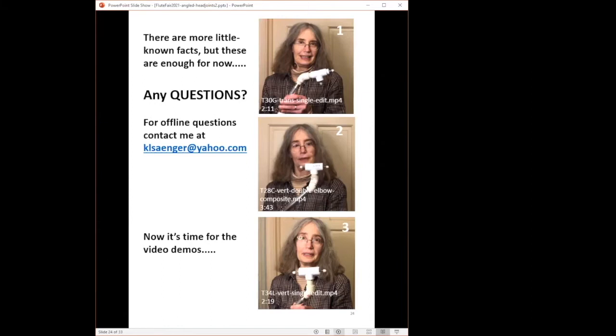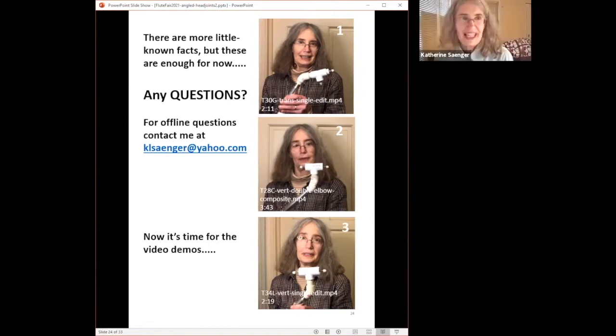Okay, and then we have another question from Sylvain, which says, what do you use to carve the embouchure in the PVC? Oh, okay. So I use my milling machine to make a hole that's 10 millimeters by 12 millimeters and has rounded edges. So I use a 5/16 mill to do it. And then I touch up things by hand with a hand carver.